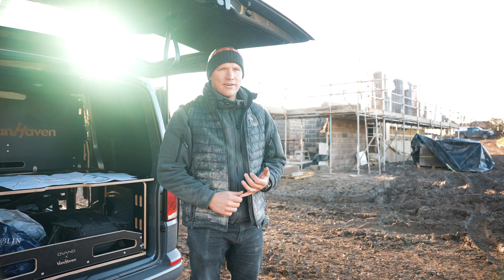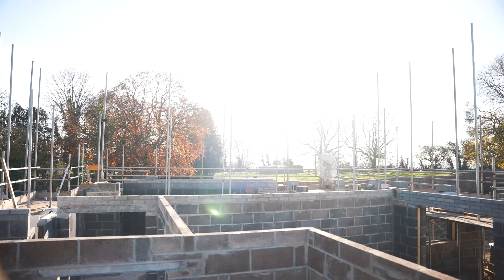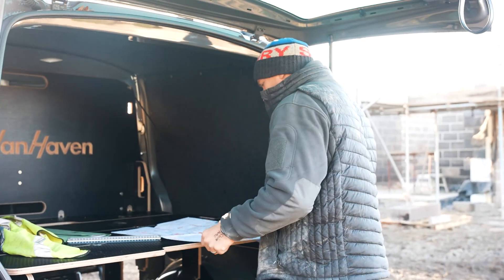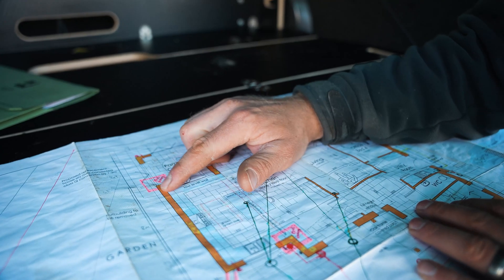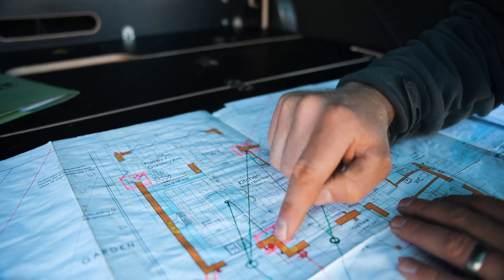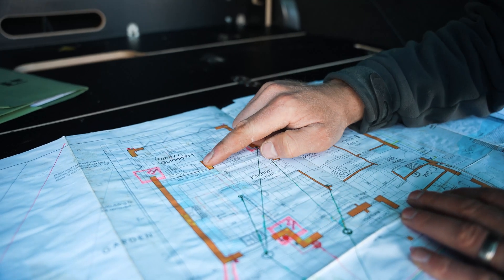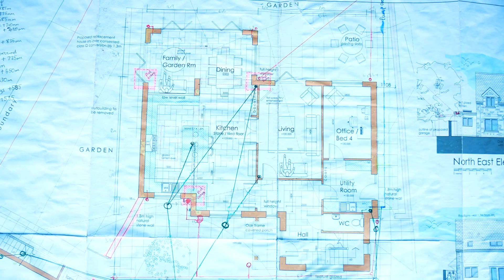Today we have got Darren and Teddy coming. They have got some steels for us and we're going to be lifting them on the house. We've got two that are sitting on this corner, going all the way across to here, sitting on top of another steel across this bifold. And then we are bolting two more steels into the side of them, so all across there as well. And that's going to mean we can lose this pillar in the middle of the kitchen. So that's what we're doing today.